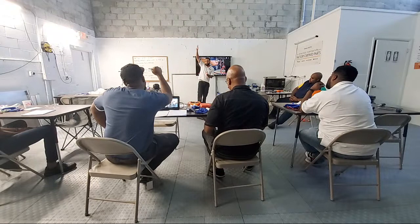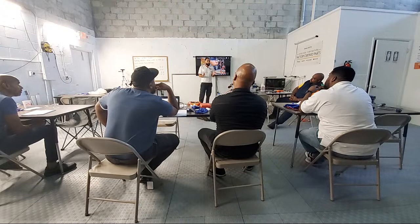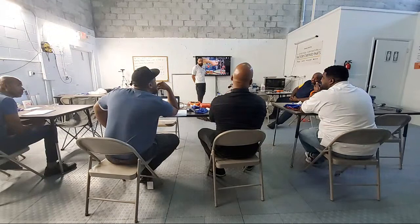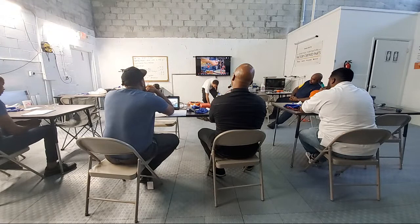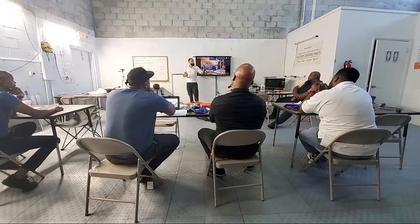So 55 would be okay if it was sitting still, not running, stabilized. But don't go off just that number. That's not a clear-cut number. You may see 53.7, mind you, I'm using digital gauges. When it's actually running, no, it's bad. You should see it down to zero. If you use an analog gauge, you'll see it running, but at 55. It should be down to zero. Inefficient compressor: we spoke about those valves, where those pistons are, not closing, not opening.